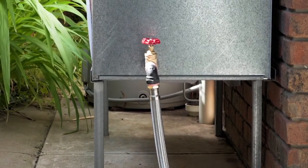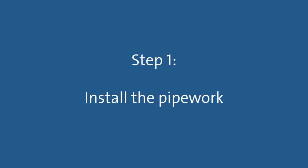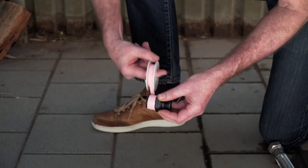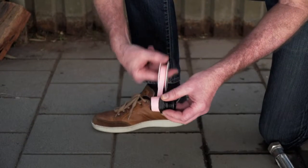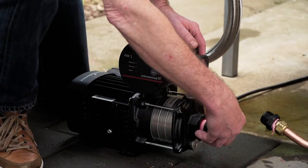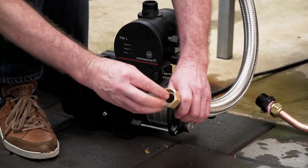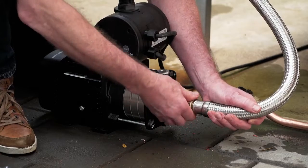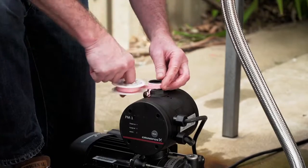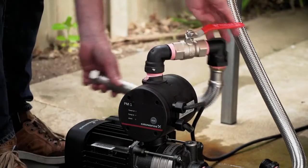Pre-checks complete. Now you're ready to install the pump. Step 1: Install the pipe work. Apply sealing tape to the thread of the inlet connection — this goes on in the same direction as you would screw on a fitting. Then connect the flexible pipe work from the water source to the pump and tighten. Apply sealing tape and connect the outlet pipe work to the pump and tighten.